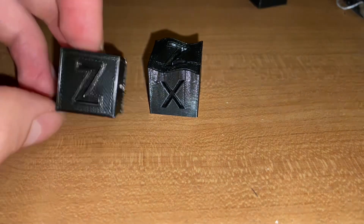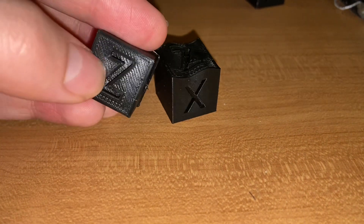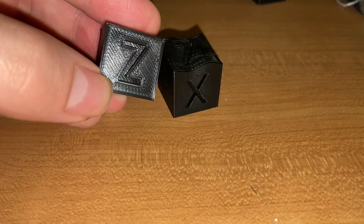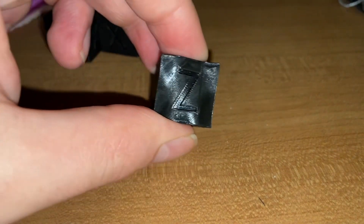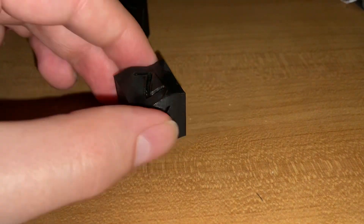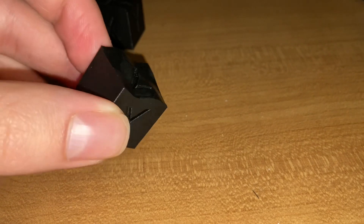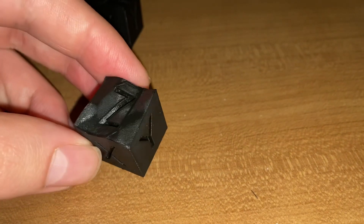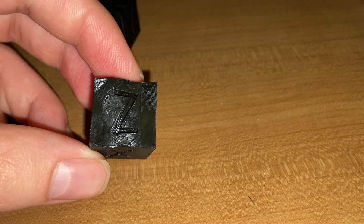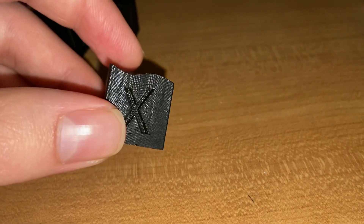Well, that's cool, but the top doesn't look exactly quite smooth. So in 3D printing there's a thing called ironing, which is basically where you go over the top layer a second time to smooth it out. And I have made what I would consider an unreasonably smooth yet still curved shape out of my 3D printer. Now I'm going to cut to cool footage of this printing to give a bit more context.